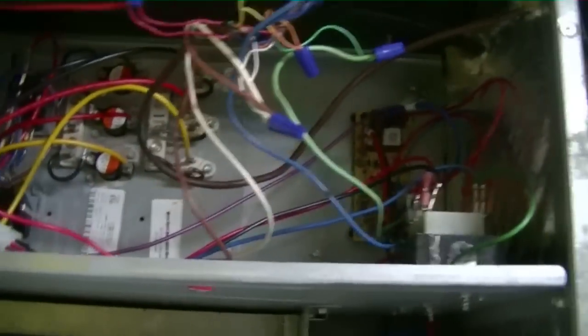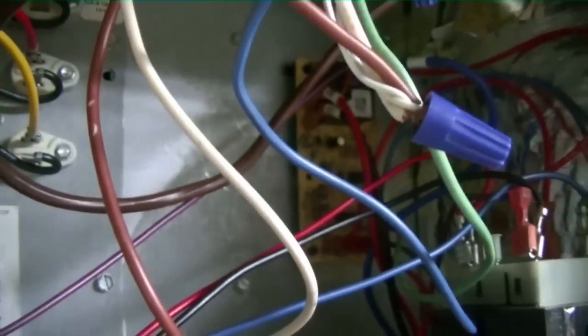Okay, it looks like our problem was in that wiring in the stat. I've got a new fuse in there, as you can see. There you go, right there. There's your fuse. No more shorting. The thermostat is blinking heat on, which means it's in delay. And we all know how delays are, so as soon as she comes on, we'll get some footage of her running. And that'll wrap this one up.